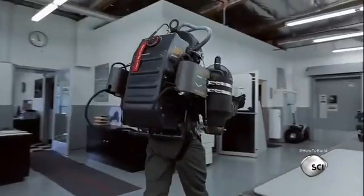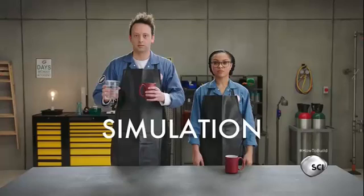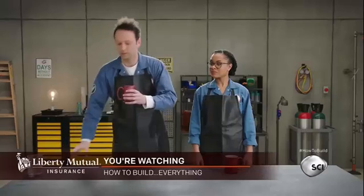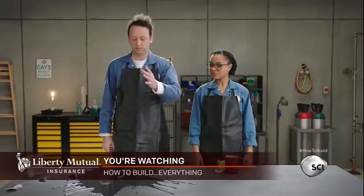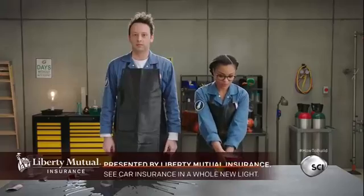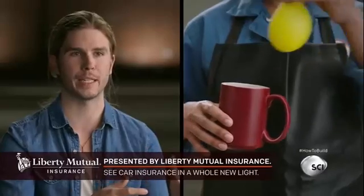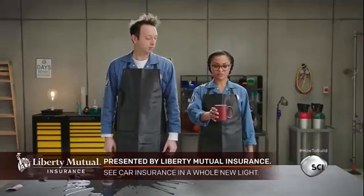We're making the tank out of carbon fiber because it has the benefit of being both very light and very strong, but the problem for something like a jetpack is that it's kind of brittle. It can crack. You're basically strapped to a whole set of fuel. The last thing you want to do is have something go wrong, then catch fire. Your jetpack runs on kerosene, which is highly combustible. Therefore, it is crucial to handle your fuel tank with care. So for safety, let's also include a rubber bladder inside of this carbon fiber fuel tank so that if it does crack, you still have that added safety of the rubber.